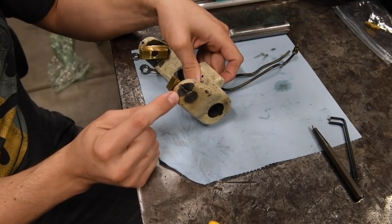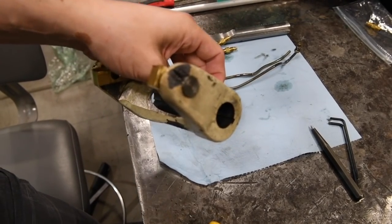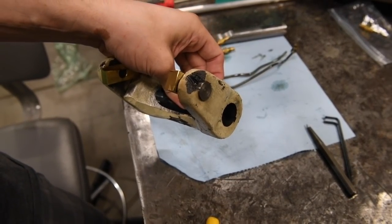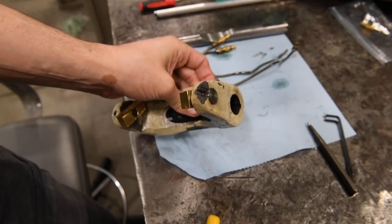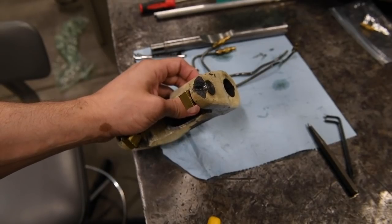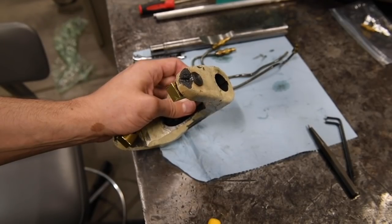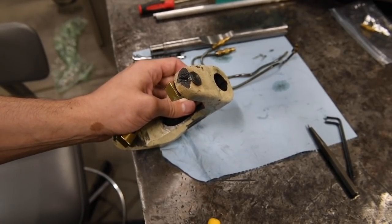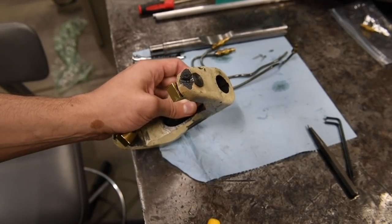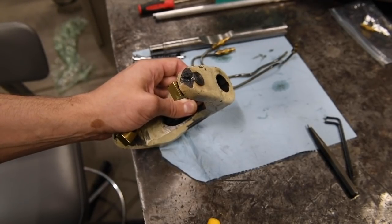The other thing I discovered, unfortunately, is a broken piece of the casting. It's broken where the set screw is supposed to be, and yeah, that's kind of a bummer. So I have to decide whether I'm going to get the pins out of there and cook all the oil out of this casting, and then braze it up, and then drill a new hole, or is it not that big of a deal?